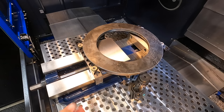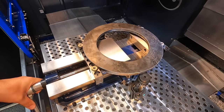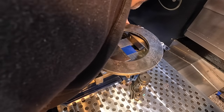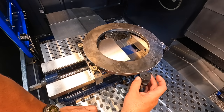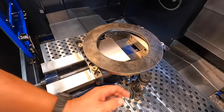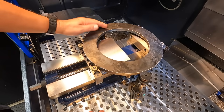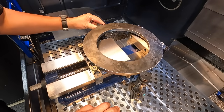Let's go ahead and get this clamped. The VersaGrips are biting in nicely. I've got the machinist jacks in far enough that they won't interfere with our drill, just enough to support the plate. I'll take a pin punch and put a little bit of preload on each jack — run it up just till it touches and put just a little preload on it to keep it from loosening up. The part is now set up.